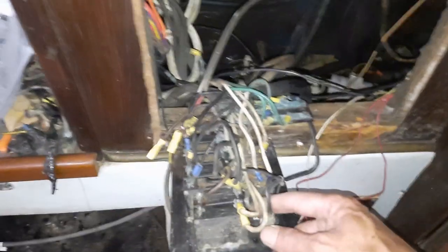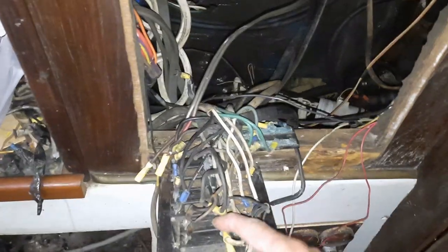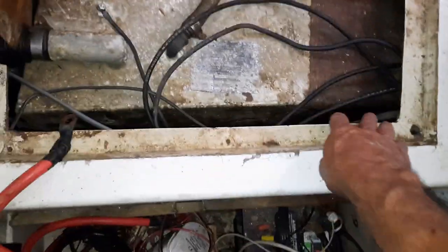You know, safety. You have a DC wire come loose and it happens to contact one of these on the back, and now you've got 110 volts running through to your light bulb. And you wonder why your light's not working, and you go to change the bulb, and next thing you know, 110 volts is running through you. So I've been rerouting everything over here. All my DC is coming through here and coming up.